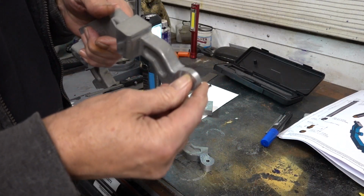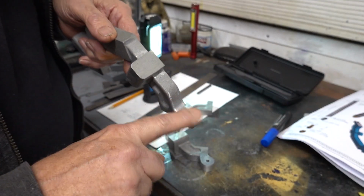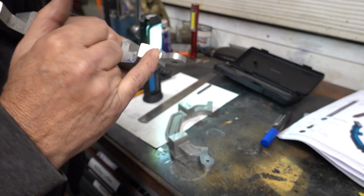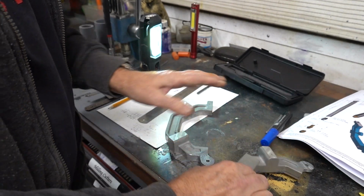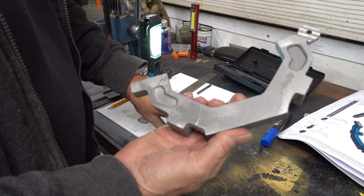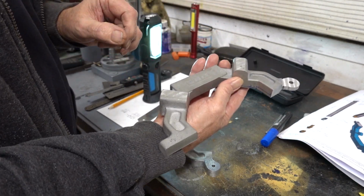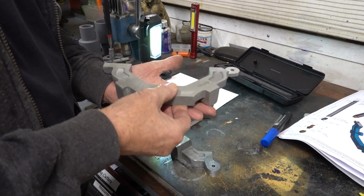What I didn't say earlier about this were, and I showed a close up of this, well, that does need dressing, but I'll dress this with a file, and there, where that mark from that cutter was, that just needs radiusing in. Other than that, really pleased with that part of it, and I'm hoping I'm going to be just as pleased with this part. See, with that it didn't matter, because that were clamped down like that on a flat surface, and on those pads that, if you remember, I'd machined, so all the four pads are the same. So when I turned it over, that was okay as well.